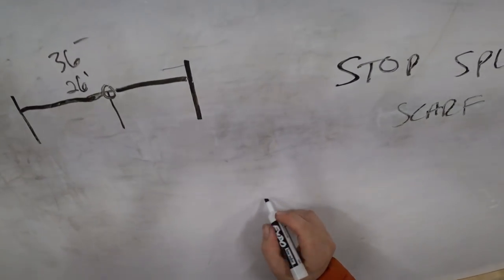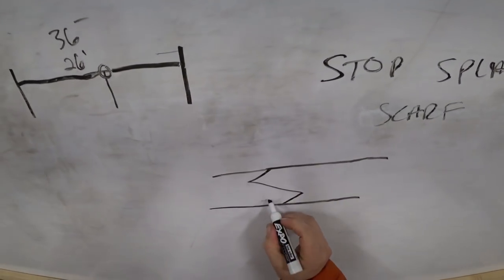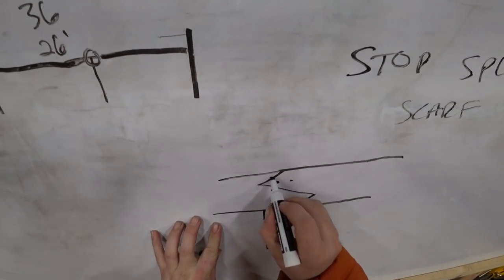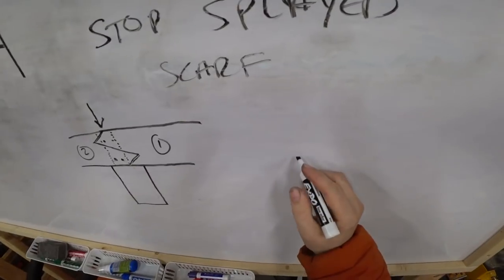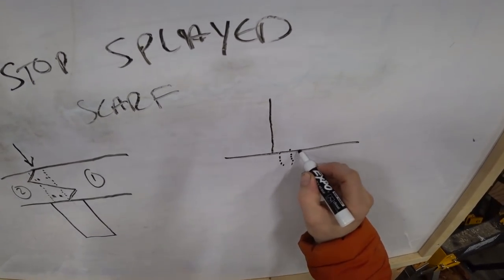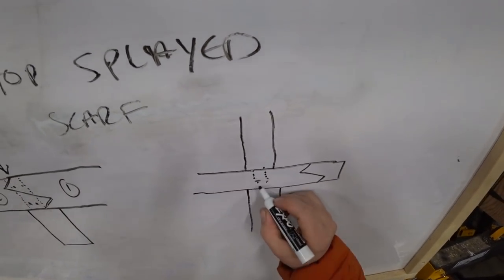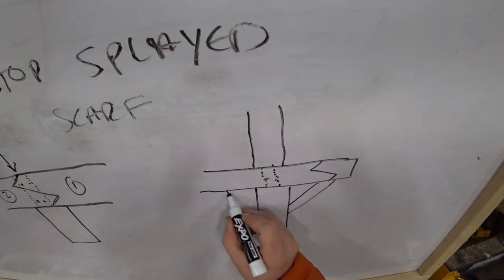The goal of a scarf joint is to create a joint that is extremely strong in many directions. So the joint looks something like this, and maybe there's pegs here, here, here, and here, and maybe we have a post that is coming up through here, and there's a tenon that penetrates these two scarf joints. So here's timber number one, and here's timber number two. In some cases, this joint would be used where a post would come down from above. So you'd have a post and a tenon maybe penetrating into something like a top plate. In that case, you may actually put this joint beside the post above here so that you don't have too much going on in this one area. In which case, this might fall over a wind brace on one side.